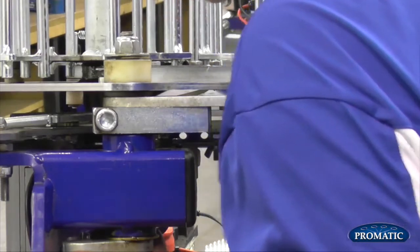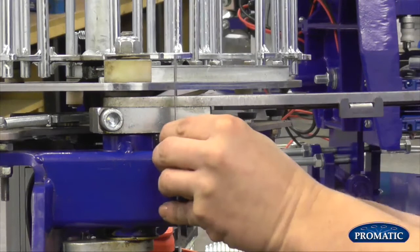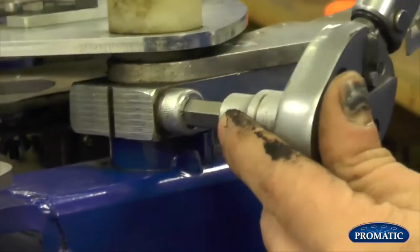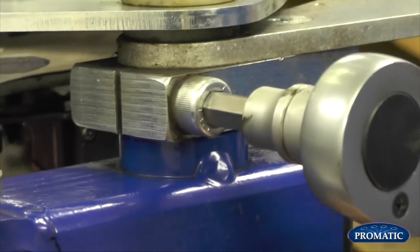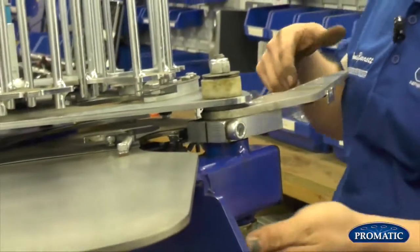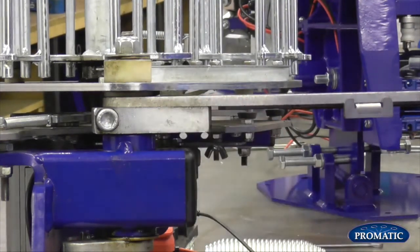Okay, we see the main shaft just poking through. We'll just get it roughly to start with. Get our two straight edges. Put your straight edge on there. Check, that's fine. Tighten them up. Okay, and then just double check, bring him round again. That straight edge one more time. One there. And that's fine. Perfect.